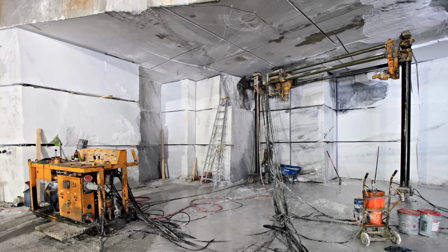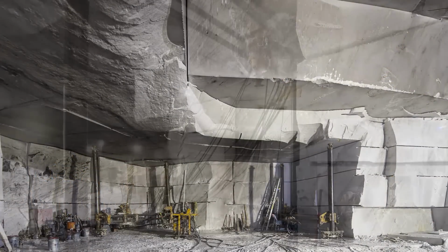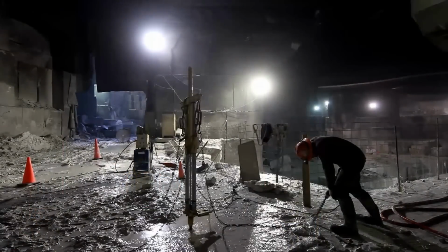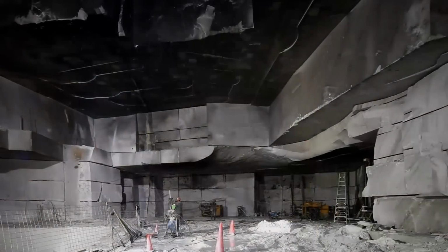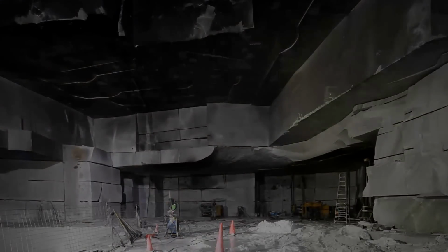You see we've got different machines working here. We've got a couple of our gallery chainsaws that actually make the tunnels. We're also running a drill here that will drill a hole down 20 feet to the next level, and then we'll start wire sawing this area out. And hopefully we can expand this way a little more, take a little more of this, and then move our access road over to our left-hand side here, and then be able to take out this area that we're standing on.